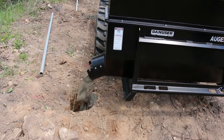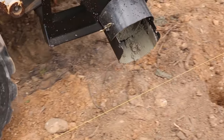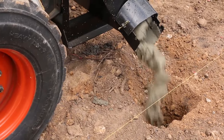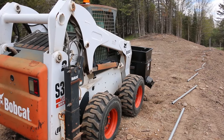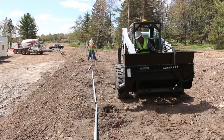The advantage of having a short chute is that it cleans out nicely — you don't drip between one hole to the next and leave a mess. Also, the guy in the Bobcat can see it a little better because he's looking straight down and can actually see the end of that chute and see how much concrete he's got to fill in that hole.